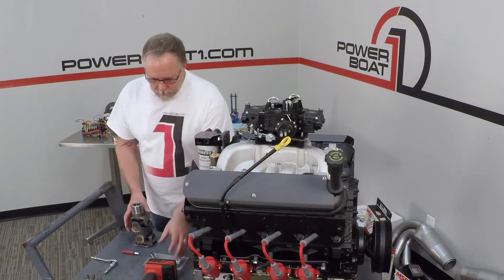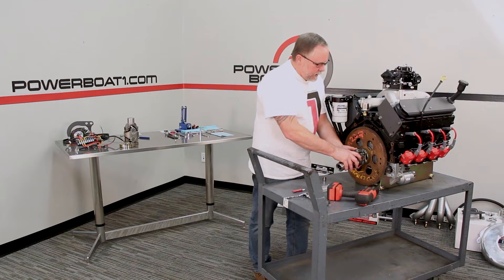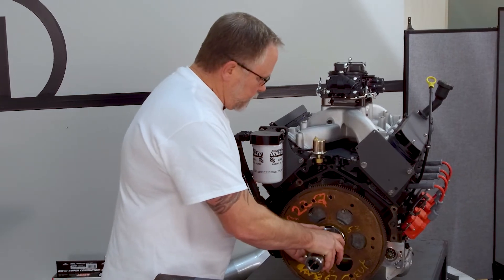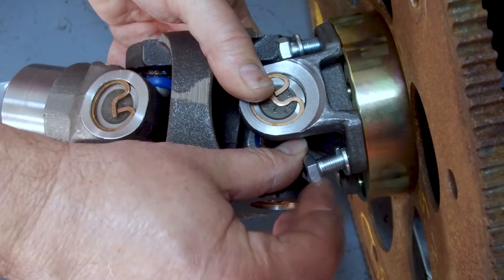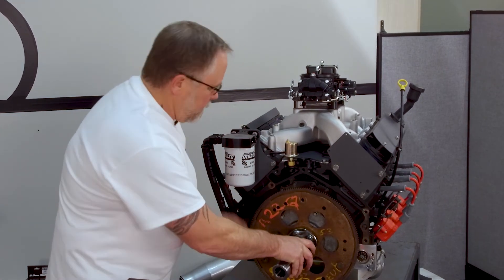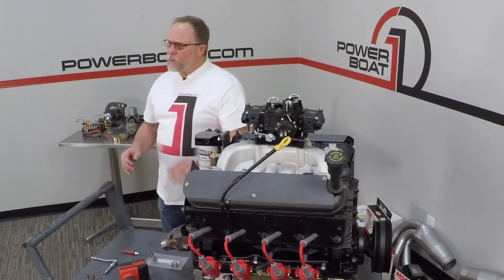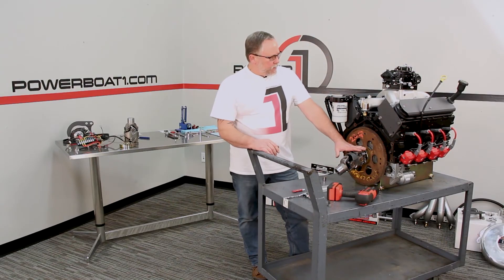You should come back and torque these to the manufacturer's specific torque for that, but for this we're just going to leave it as is for now. The drive shaft assembly will actually sit right in there — it has a register also that sits in this register, so you'd center that up, make sure that your bolt pattern is aligned, and then these bolts would just affix right into the PTO. All four of those will go in place, you get those tightened down and it's up on the back of the PTO mount.